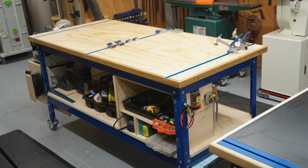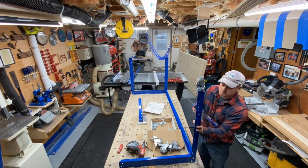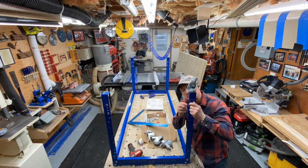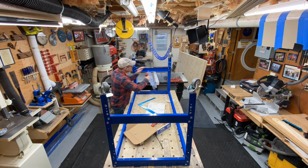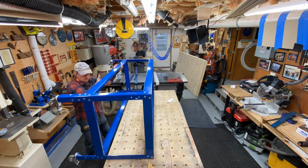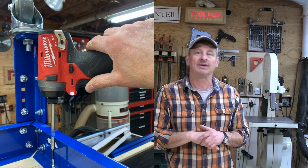Now, the Kreg Universal Workbench is a system of rails and adjustable height legs that basically are available in multiple sizes. I was actually impressed with the number of sizes. So by combining 2 different size legs and 5 different sized rails, you can create a customized workbench with a lower shelf, a tool stand, an Outfeed table, or an assembly stand. I did both. The Kreg Workbench comes in 15 different sizes, and you can do something as small as 14 by 14 inches up to 64 by 64. I did like 30 by 68 or something like that. There's 2 different adjustable height legs. The first one is 31 to 39 inches high. Second one is lower. It's 17 1/4 to 23 1/4 high.